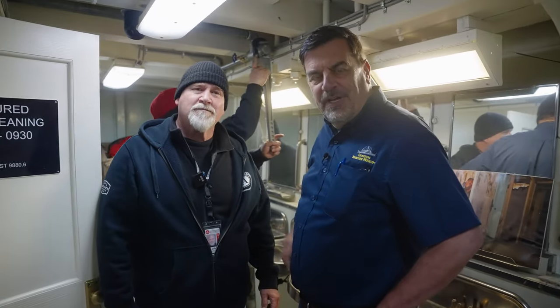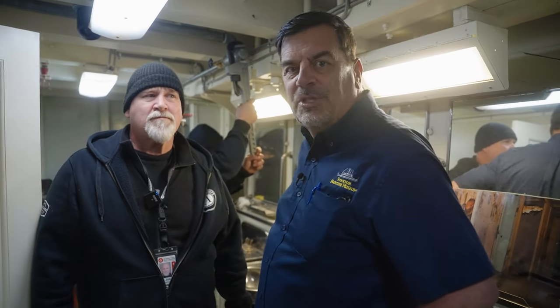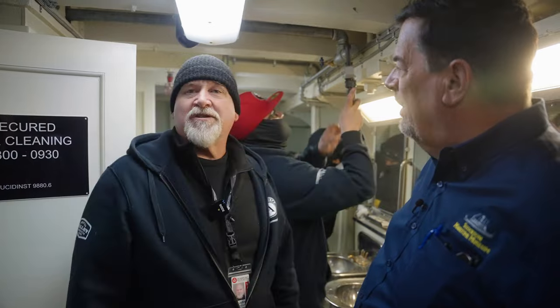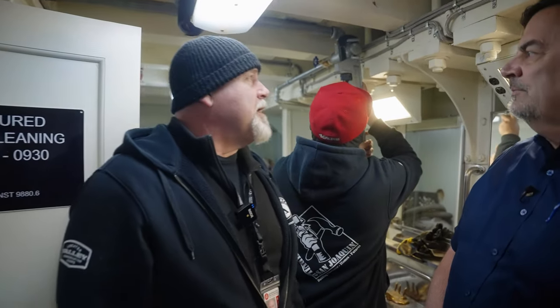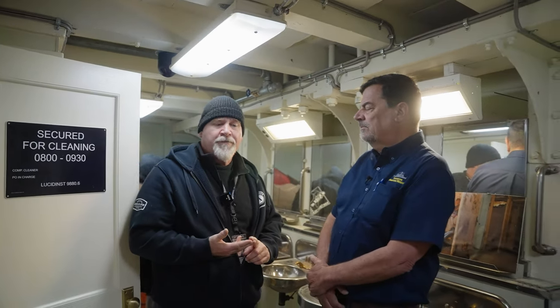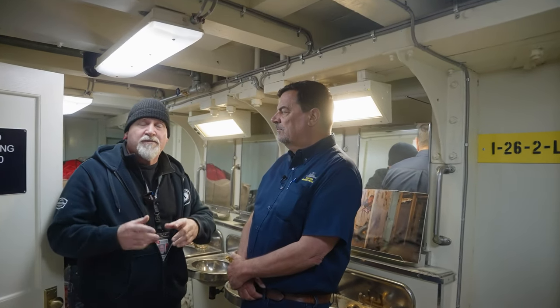Here we are in the crew's head. I'm going to have John Van Hustie, our Building Futures Academy instructor, describe what's going on in here. We have a couple of students right now from the YouthBuild program with Building Futures Academy. We're installing the fresh water system for the main sailor's head — bringing one and a half inch pipe in and diverting it down to all of the sinks, heads, and showers. What they're learning right now is how to do the measuring, cutting, and threading of galvanized pipe. These are at-risk students from San Joaquin County, and we're teaching them life skills and trade skills — trying to get them prepped for union work. When they leave, they have certificates from OSHA, first aid training, and MC3 training, which gives them a head start getting into a union apprenticeship program.